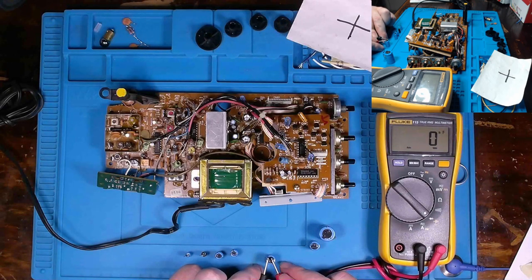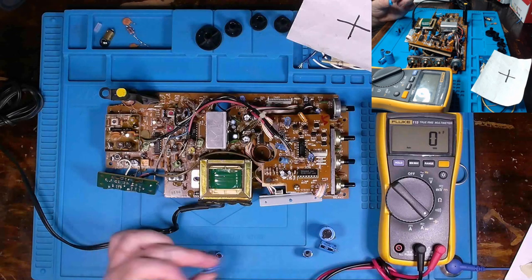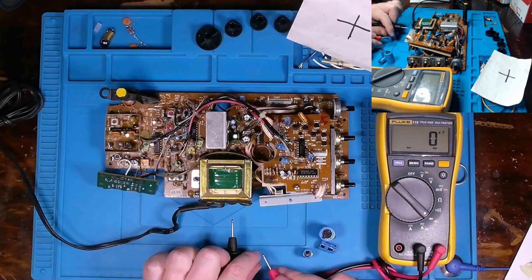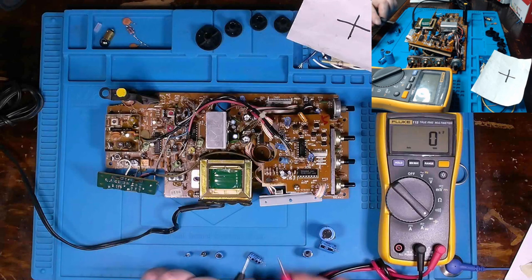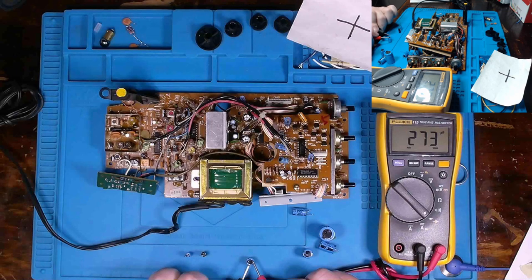All right, here goes another 470, 16 volt cap. Yeah, 584, 570. Outside of that tolerance, outside of 20%. It's coming out. What's another one we can do? Let's see. This one was 470 at 10 volt. I don't think this one was outside 20%, but I think I pulled it out of an area that I felt like I needed a little more accuracy with, for whatever this was supporting. But 490, you know that's within 10%, if I'm not mistaken, but that's still slightly higher. I went ahead and just changed it.